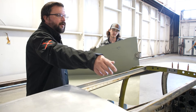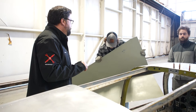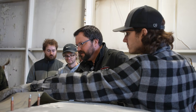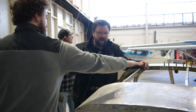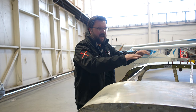Do a lap joint — one going from there to there, and then a flat piece over the top. That may be the way to do this. So what we'll do is we'll break this down into three different skin pieces. We'll need to cut this out and trim it — three parts — and then this one will be lapped over the top of the other two.